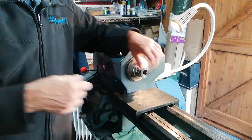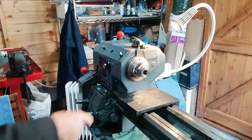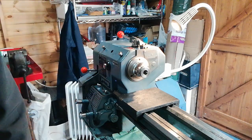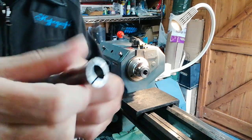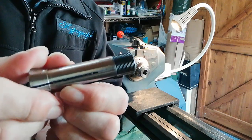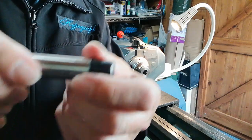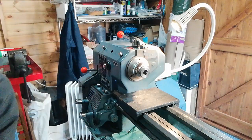The arbor is now in position to receive a collet. I've selected a half-inch collet here. It works on a draw bar system that goes down the spindle of the lathe and screws onto the thread, which pulls the collet into the headstock.